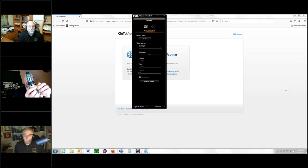The way to adjust this, like I said, it comes already set for 12 PSI, you're good to go. But if you want to change that pressure, you take the black part on the top here and loosen it. So turn that counterclockwise. That's your locking ring. In order to change the pressure, you then grab the green knob. If you can see the green dot down there, you're going to see it moving as I turn that green knob, and you're going to get an indication of where my pressure is. And then once you're done, lock down the black knob.